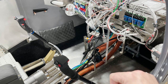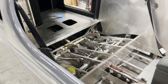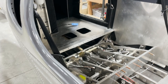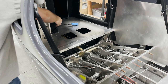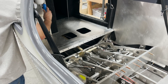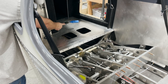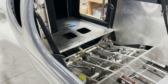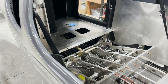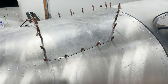Once you've installed your panel for the first time for a test fit, you'll be able to get a final length and position for your parachute pull cable and secure it in its appropriate position. Most importantly, for the initial assembly you want this length set correctly so it lifts up with a little bit of play and installs perfectly to the rocket. Leave yourself a little bit of play and everything should be good and ready for final assembly.